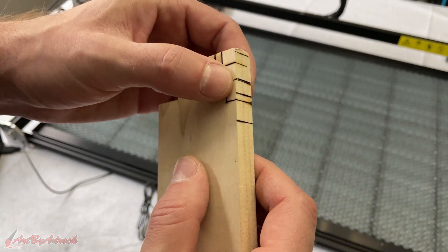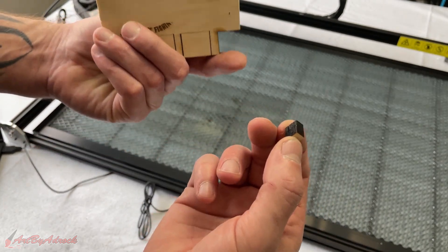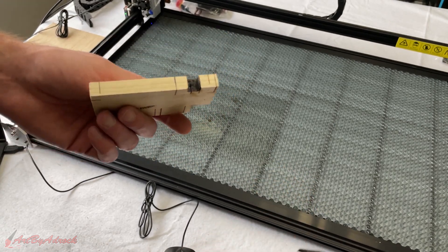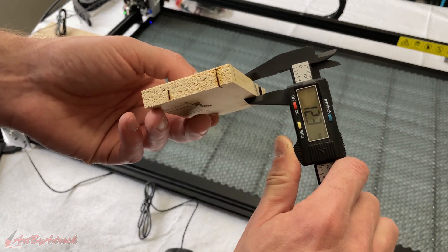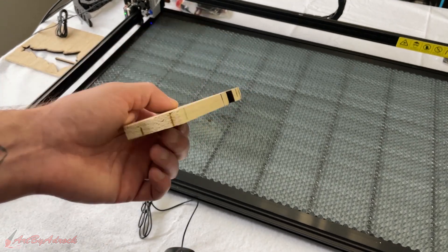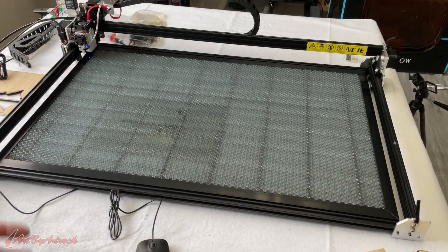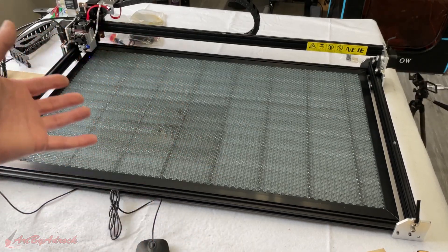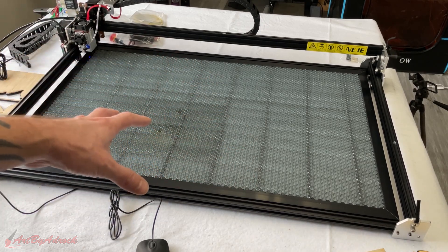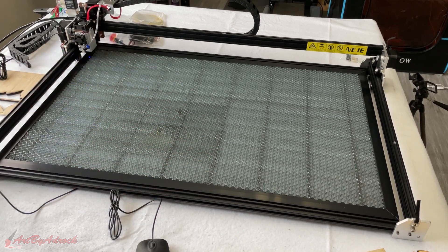That was two passes and yes, that did cut it out. Two passes at 100 millimeters per minute at 100% power managed to cut out this wood that is just over 12 millimeters. Will it cut 18 millimeter plywood? Probably, but you might need a couple of passes. Since I have this all set up with this nice large bed, I might as well engrave something bigger to actually utilize the full size, so I'll grab a larger piece of wood and see how that turns out.